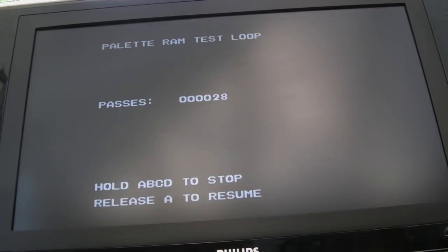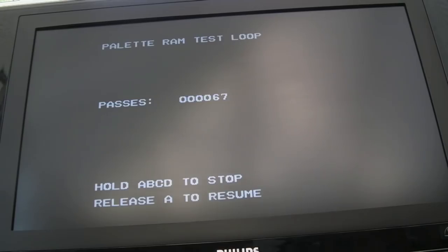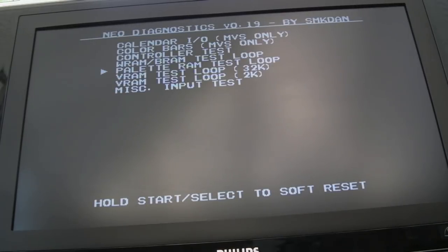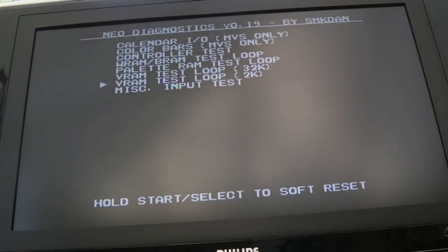All tests passed! Yes — I was right to follow my instincts. Continuously swapping those backup RAMs around would have been crazy. I think all three SRAMs I had on there at different points were probably okay. I'll keep those and perhaps test them at some point. I don't like sticking chips on and off repeatedly because you can damage them with heat and handling unless you're taking proper ESD precautions. That's great — that's solved two problems: the backup RAM problem is gone and the palette RAM problem is gone.